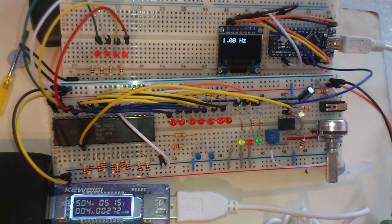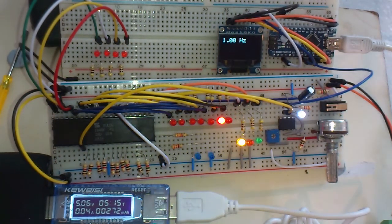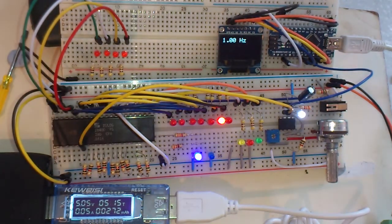There you go. Now we're back to 0. Count 4, and then the next 4 cycles will go up to address 1, and then it will go up to address 2 after the next 4 cycles, and so on. Okay, so that's just handy to have that on a micro switch. So what was I saying?